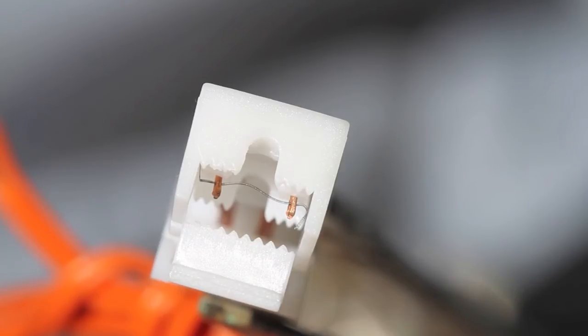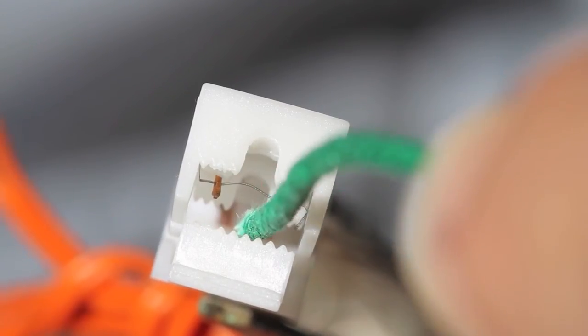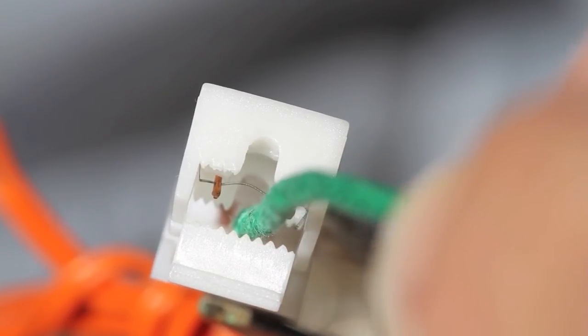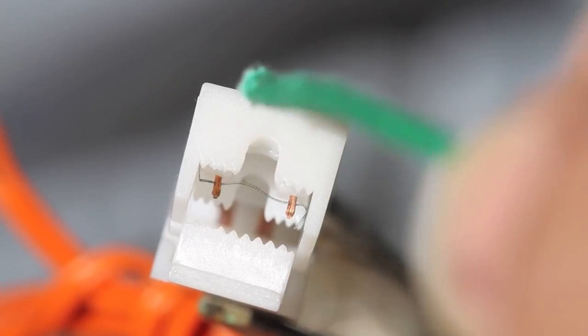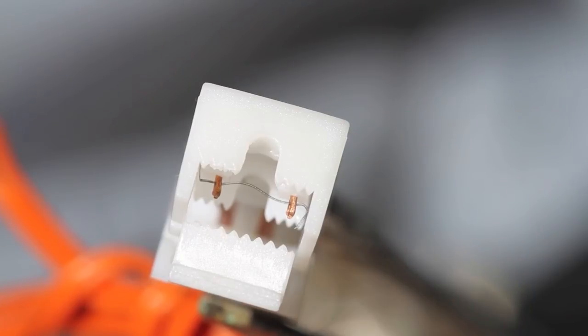When you put your fuse in there, with this orientation of the clip, you want that fuse underneath the wire. I can't hardly see what I'm doing here, but I think I probably laid that fuse in there under the wire — I don't have my glasses on. What you want to be careful of is when you put that fuse in there, you don't put it up near the top and shove it in so that you'll snag that wire and break it.